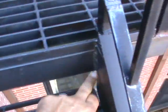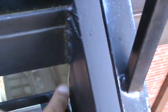All welded, fairly new, probably in the past 10 to 15 years this fire escape was installed. I'm sure with a permit. Looks like it's part of a condo conversion. All right, my first concern is, again, welded connections, okay, all welded. And as you can see already in here, water starting to intrude into the weld, so this needs to be x-rayed or load tested, or if you put in a clip here and you bolt it on both sides, you can leave the original weld bolted, there is no liability.